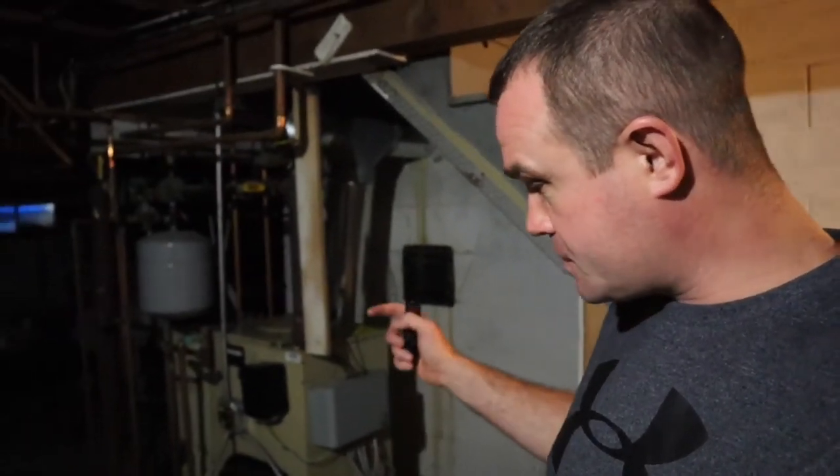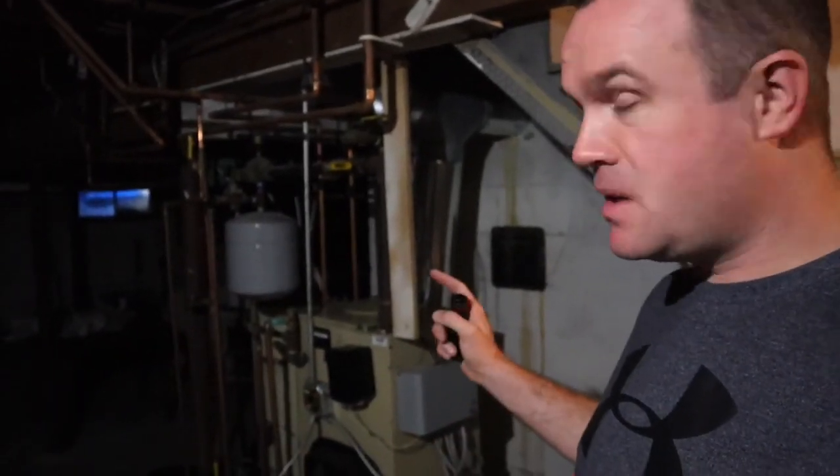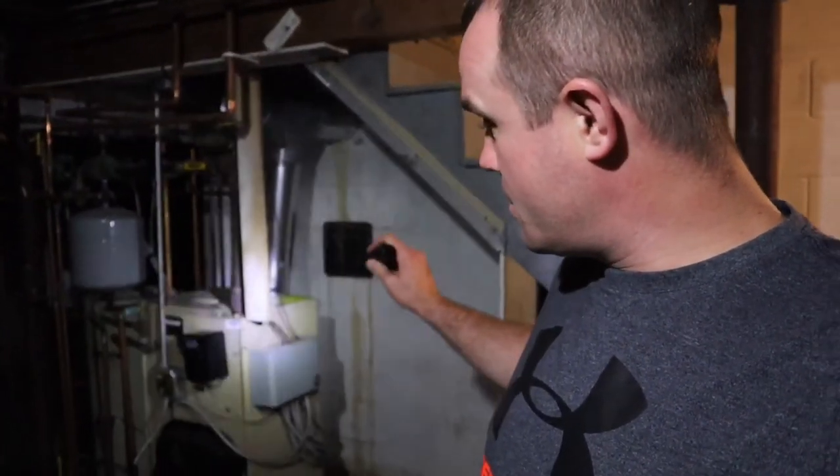The next steps: I lit off the boiler — it does light off, looks good, runs well. But the final remaining step is I need to get in touch with folks who have those expensive combustion analyzers to tune the boiler and make sure I'm running at optimal efficiency. Those meters start at six or seven hundred bucks and go up to thousands of dollars, so I just don't have one. I'm figuring maybe a hundred bucks to get somebody out here to tune it. But it runs well, lights off, brand new chimney, brand new oil nozzle — good to go for the winter. Thanks for watching, guys. Remember to like, subscribe, and comment.